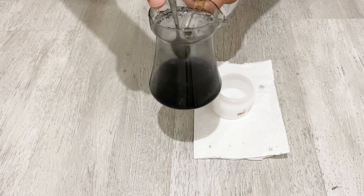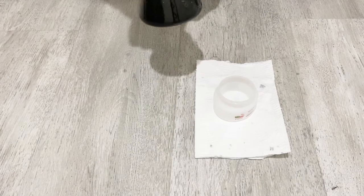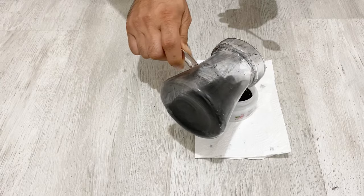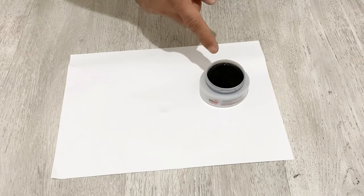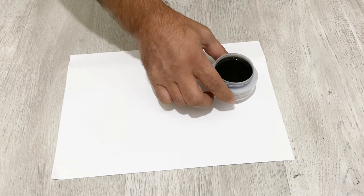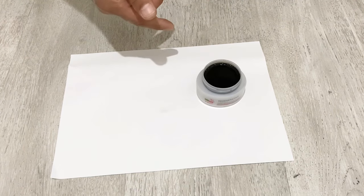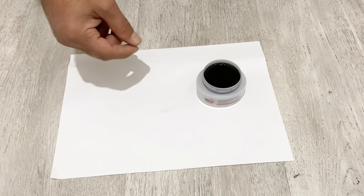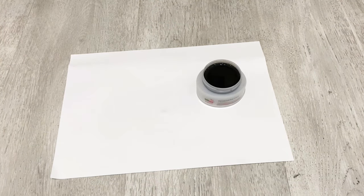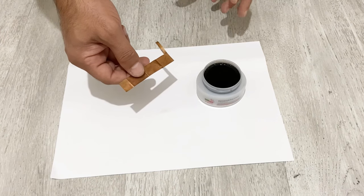After boiling the solution for about 10 to 15 minutes, I am going to put the solution into a nice plastic container and let it cool. After the whole process we get this very nice, beautiful conductive paint. It looks a little like conductive ink, but if you let it dry for a few days it becomes a conductive paint. You can use this conductive paint for graphite-based batteries and to make some electronic circuits.